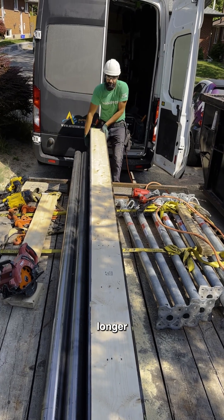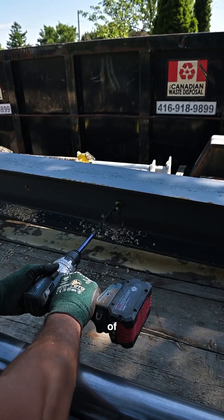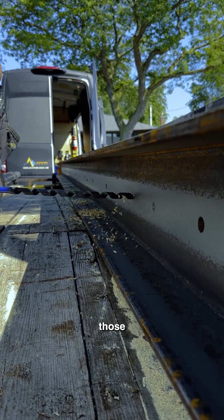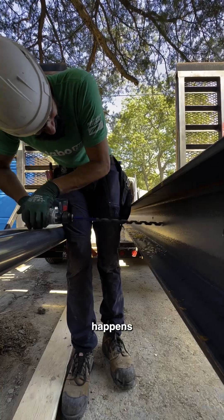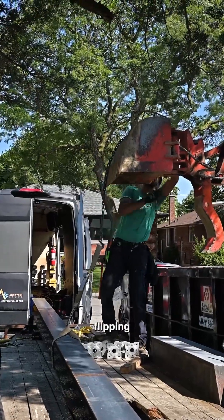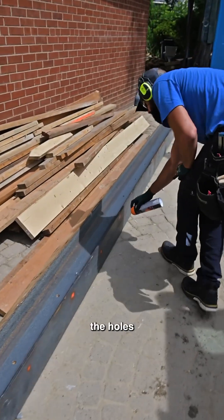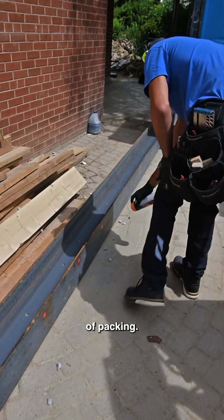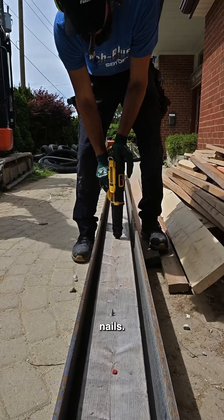Now I flip the beam over and drill through the back of the holes I previously made through both layers of packing, to locate those bolt holes. We flip the beam using the excavator because it's pretty heavy. I'm using spray paint to mark all the holes on the top because now I need to attach the other layer of packing. This is the powder gun again, using inch-and-a-half power point nails.